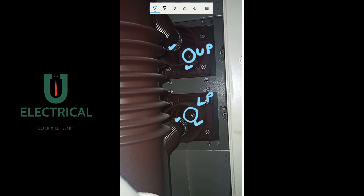Until the contact is perfect — meaning contact resistance is at minimum — you will not be allowed to rack out the handle or remove the key, and you will not be allowed to switch on the circuit breaker. The shutter operation is designed to protect the operator from any flashover or arcing during an intermediate position of the breaker. The shutter moves with the shaft installed on both sides of the CB frame.